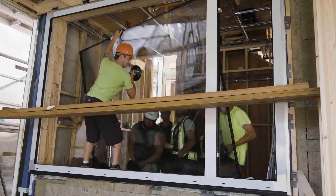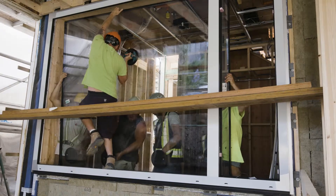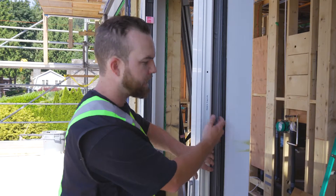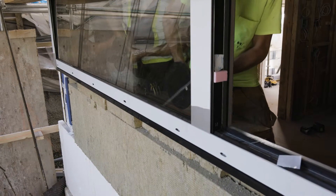The glazing techniques are similar — we use vacuum cups on any heavy glass over 800 pounds. The aluminum framing is thermally broken with foams. So the installation methods are very similar, but it's a lot of different products and a lot of different procedure. We're doing a lot more thermally insulated frames for energy efficiency, especially on these passive homes.